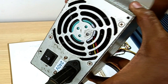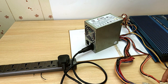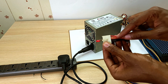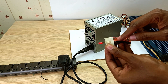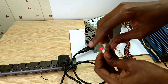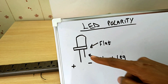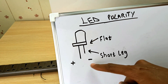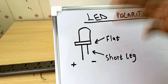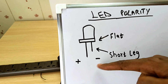But we need a much better method to see if the power supply unit is on, and that's why we need a small LED like this one. That's also why I taught you about the orange cable — the orange cable is 3.3 volts, and you just need any simple LED connected between the orange and black. If you buy a brand new LED, one short leg is the negative and one long leg is the positive. If you removed it from an old circuit and don't know which is which, the flat side on the LED is what you connect to the negative.